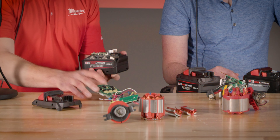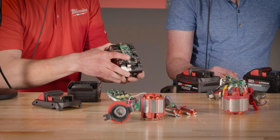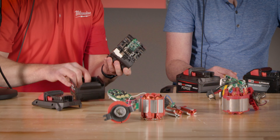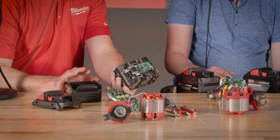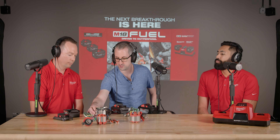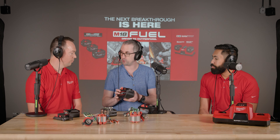With the Forge 8.0/12Ah, we're using tabless cylindrical cells in a steel can. We're rapidly forcing air through the entire battery pack, wicking away all the heat from the inside of the cell out to the can. The tabless cells are wrapped in a cylindrical can that acts like a heat sink — it wicks heat to the outer part of the cells, and you force air between the cells. It's kind of like a hot car in summer: you crank down the windows, it cools a bit, then you drive and the airflow cools it faster. That's what the charger does — when charging, it builds heat in the battery pack, but cool cycle forces air through and cools down the cells. Cooler cells mean you charge faster.